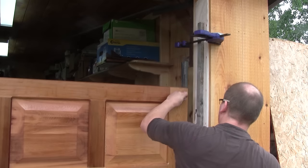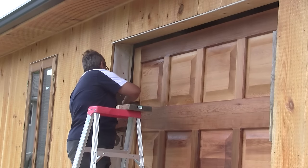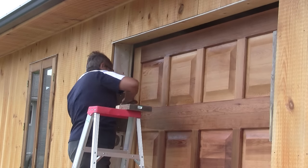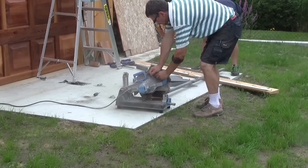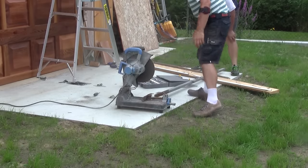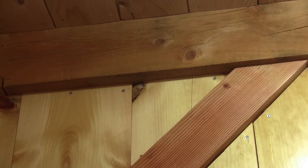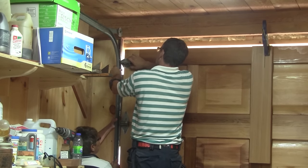So I finish the rest with René. Now I need to cut a piece of the horizontal section of the rails. If you're wondering what kind of modifications — I have to cut some metal parts from the rails because of the way the top of my walls are made. Not too many garages have a visible beam right on top of the garage door, so I have to remove a little bit of metal so the rails will fit on my wall.